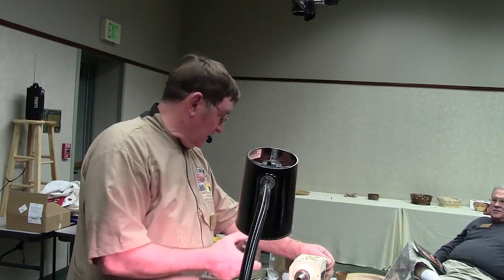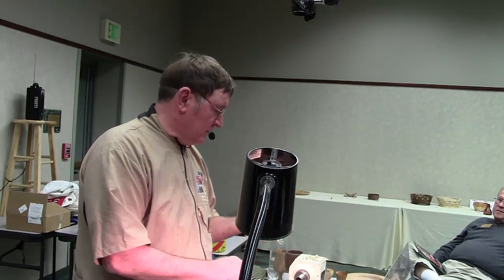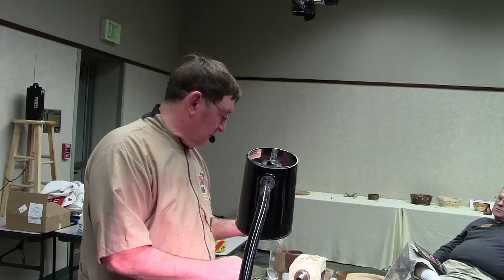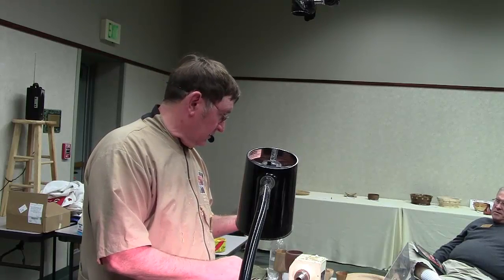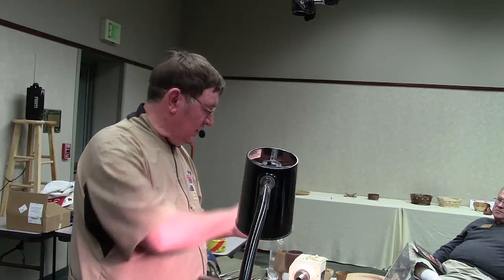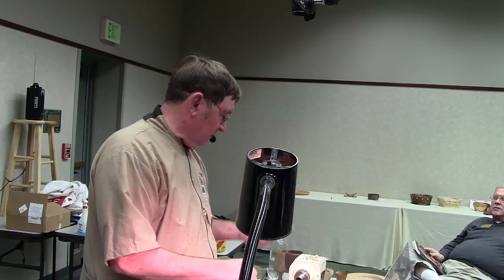My maintenance engineer took care of that for me. That's John. He actually would take it apart, soak it in some solvents in case there's any gum and resins in there, and then reassemble it. Then you can take this chuck key and spin it like that, and everything just moves almost frictionless. Okay, good.